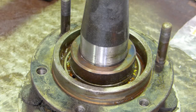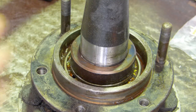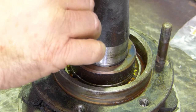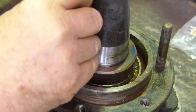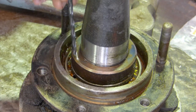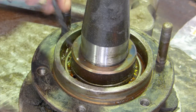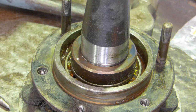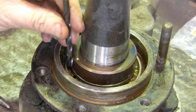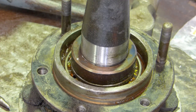Now, the first thing I choose to do when doing this job is drill the collar. My normal procedure is I come right over almost near the chamfer and put a centre pop mark there, a nice big one, and we have a small drill that we're going to run down there. The idea is so we don't run across into this housing here, or into this nice surface. I usually go with a small drill first, and then we open it out. We try and keep the drill as straight as we can. Sometimes at the top of the drill the chuck gets in the road, but we'll get it underway and see how we go.